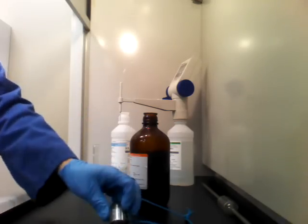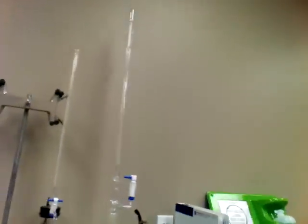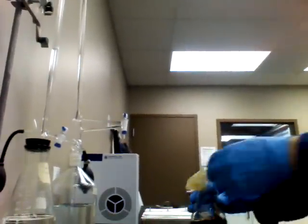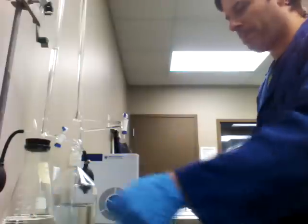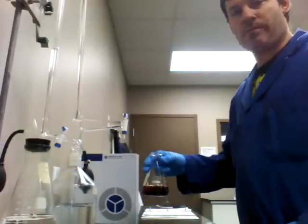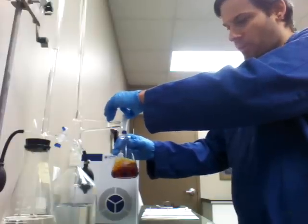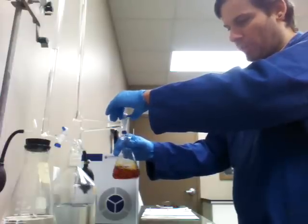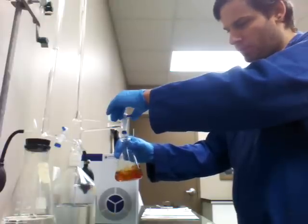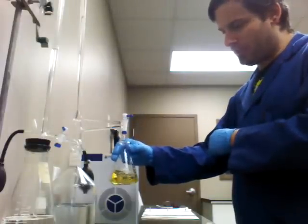It's been 45 minutes and now we're going to take our sample from the dark and bring it over to the burette. We added 50mL of 0.1N iodine which oxidized with the sodium hypophosphite. I've already zeroed the burette and we're going to start slowly adding our 0.1N sodium thiosulfate. We want to go from this amber dark color to a clear endpoint. You can add it fairly quickly until it starts to change color, and then you want to slow it down — you want to know exactly how many drops it takes to turn it clear.